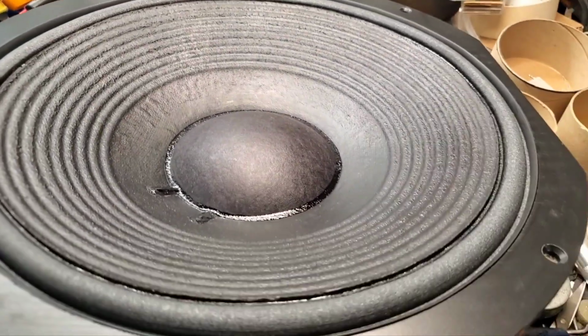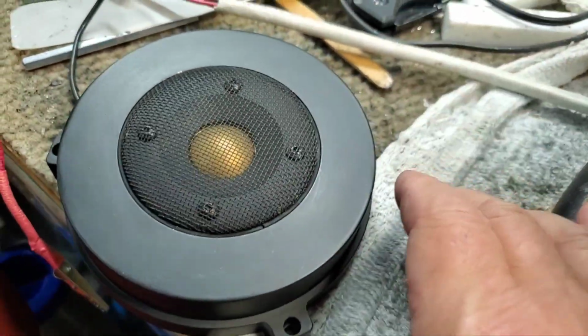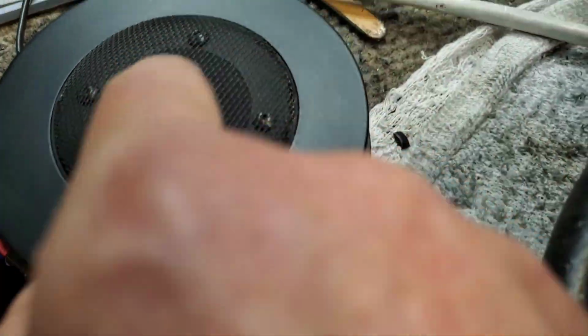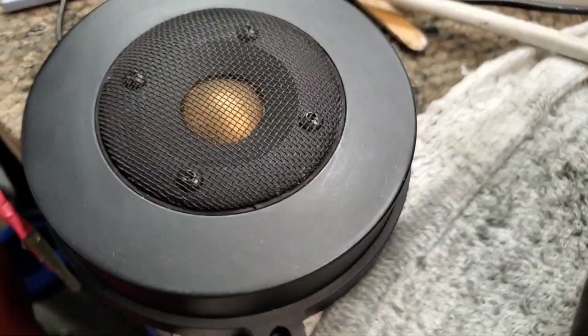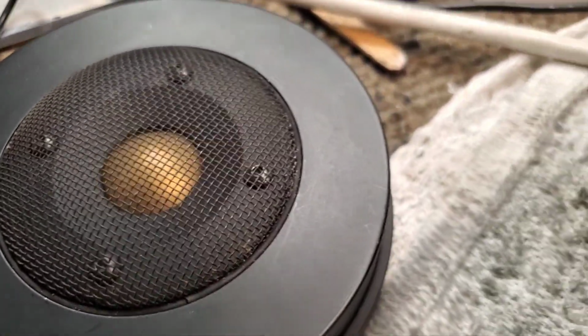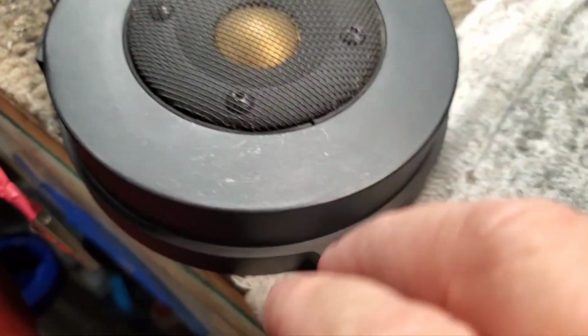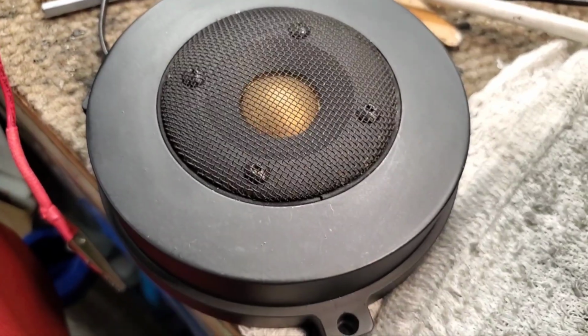So, all right, next, the repair of these 2 reconed LE14H-1s came from an L250, and the 044-1 was not functioning. So what I did, I disassembled it, and there was a break in the voice coil wire, so I repaired that by taking a winding off each side of the coil and attaching it to the terminal wires, and I'll sweep it here in a second.